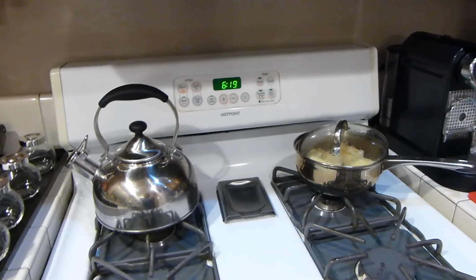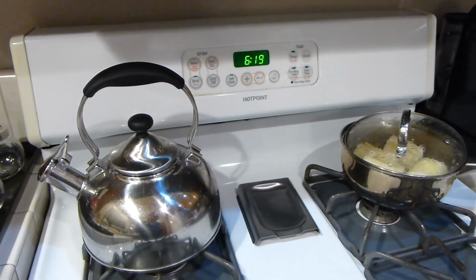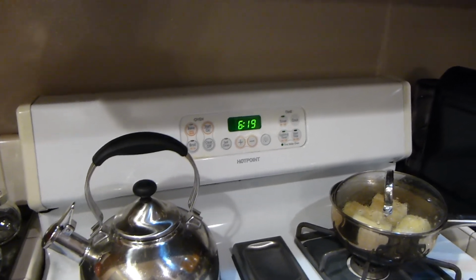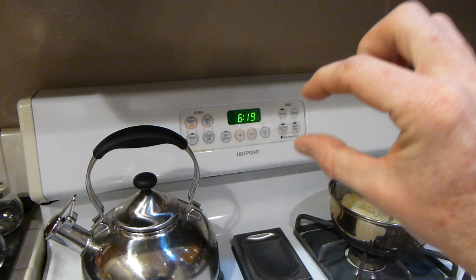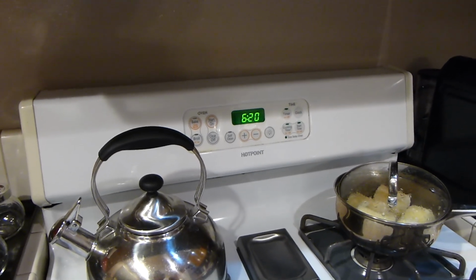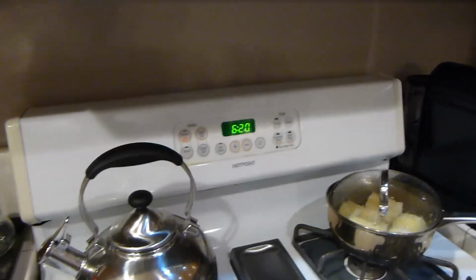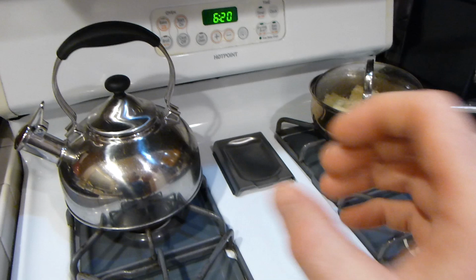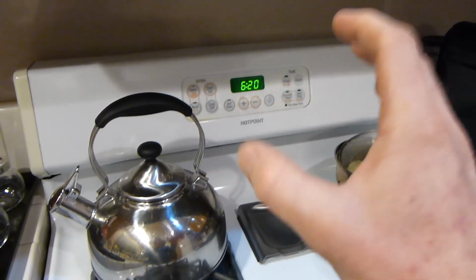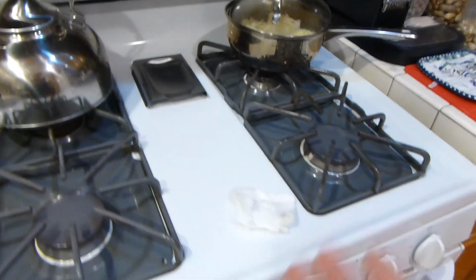All right, guys, what we're going to do now is we're going to be preheating our oven. You guys that use Celsius, go ahead and put it at 200. Everyone else that uses Fahrenheit, we're going to go ahead and do, because ovens mostly do 5 degrees in chunks, we're going to go ahead and go with 385. Solder melts at 365 degrees Fahrenheit. And remember, if you're placing this on cardboard, which I wouldn't recommend, but if you do, it's okay, but don't have your oven go above 451 degrees Fahrenheit, or you will light a fire on the cardboard in the oven.